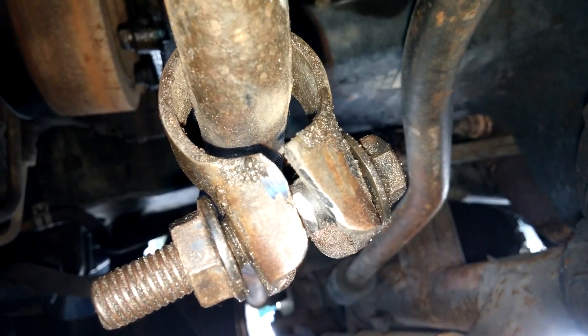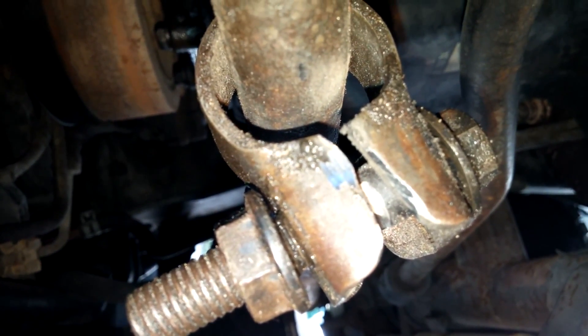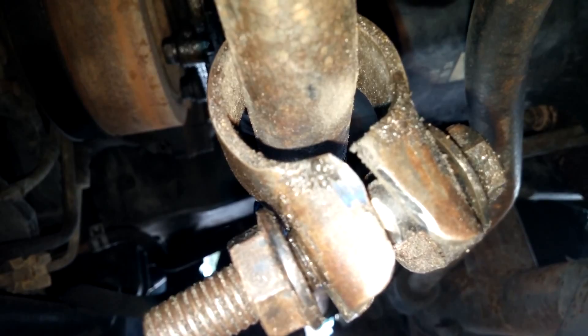As you can see, I took a little bit of material away and created a gap. I think I only took about a millimeter, but I think that'll be enough to tighten this thing down as much as I need it to.